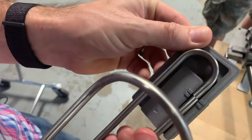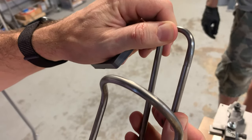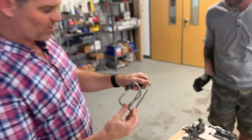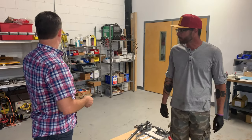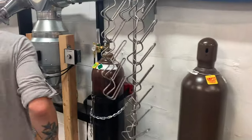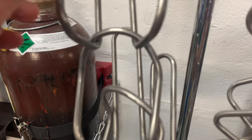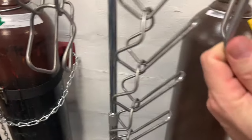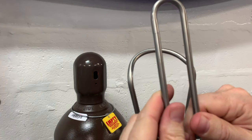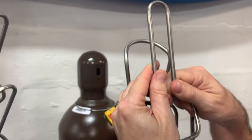There we go — right in. You can see them close up as we open and close; we can't even see daylight through it. So we call that a good one. We rack it, ready for butt welding. You can see the precision needed for the gap there — that's our 0.15 millimeter face-to-face.